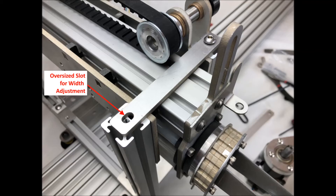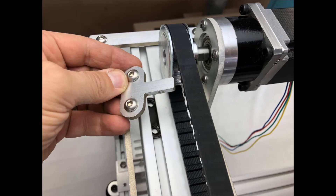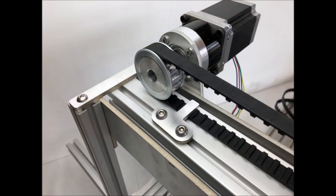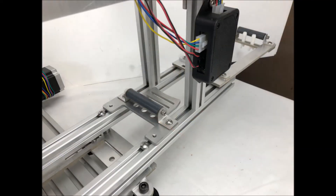To accomplish this, there are two ways to adjust the width of the upper plates. The distance between the front two vertical posts can be adjusted by the oversized holes on the horizontal bar that connects the two posts. Second, insert the 3.5-inch socket head bolt and nylon lock nut as shown and tighten to adjust the vertical plate width and hence the alignment of the sliding bar. Next, secure the linear belt to the sliding bar by installing the clamping plate as shown. When the slide bar is fully retracted, the clamping plate should be secured in the most rearward position without impacting the motor gear. Next, install the extra long wire limit switch as shown and plug in the two motors and two limit switches into the black junction box.